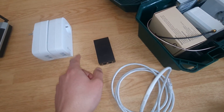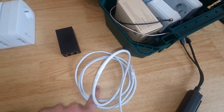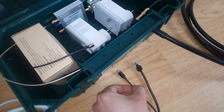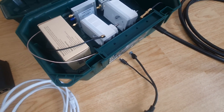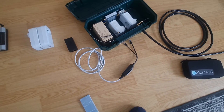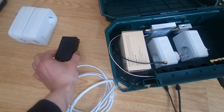From that power and ethernet I put them into this PoE injector. It will inject power and internet into the cable, and at the end I'll have 5 volts with this splitter and an ethernet cable. That's a quick and dirty explanation of the PoE setup. I made another video showing how to do it with a PoE switch.